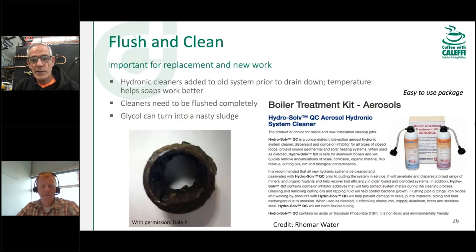There's an answer here to one of the questions — this is one of the brands I'm familiar with. They make a detergent-based product and an acid-based cleaner, and they'll answer questions if you tell them what you're up against — you can see all the different metals it's safe to use on. The image here shows glycol sludge — when glycol goes bad and starts eating away your system, you get a really heavy, oily sludge, almost like grease gun grease, that stains your fingers for a week. You need good fluid, good flush velocity, and a cleaner to break this up — you can blow water right through the center of it without dislodging any of the stuck sludge.